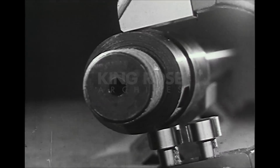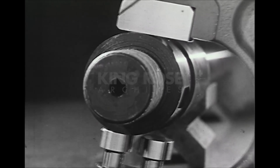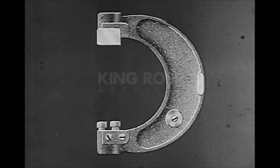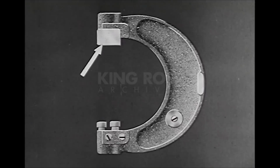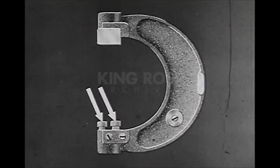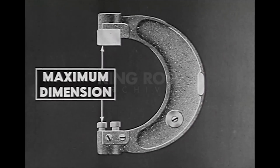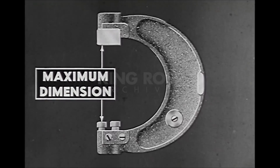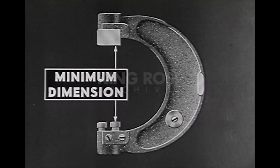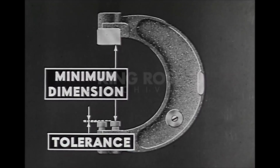Snap gauges are fixed gauges designed for taking outside measurements. They are made in a wide variety of sizes and designs. One of the most commonly used types is represented here. It has a large flat gauging surface called the anvil fixed on one jaw and two gauging buttons in the other jaw. One, which is called the go button, is set at the maximum dimension allowed by the tolerance which is specified for the work. And the other, which is called the not go button, is set for the minimum dimension allowed. The difference between the two is the tolerance allowed by the gauge.